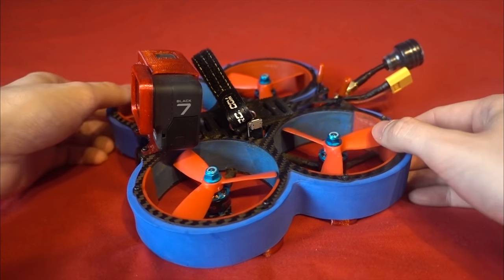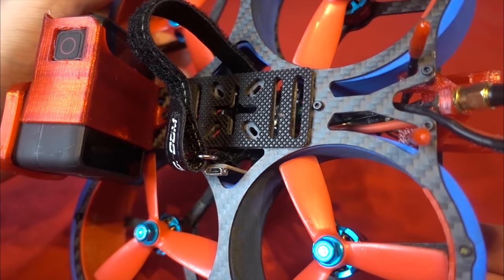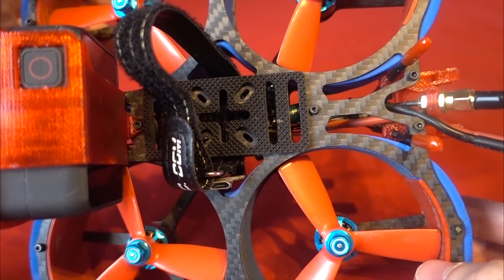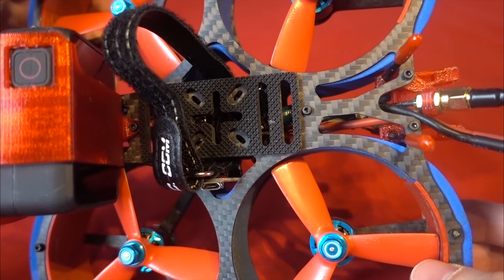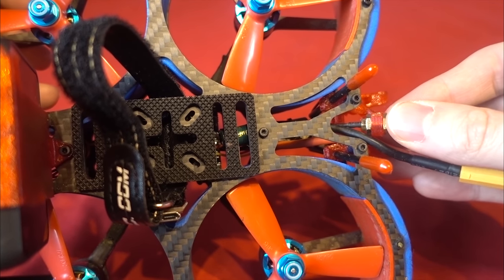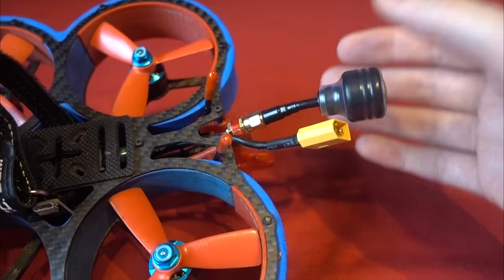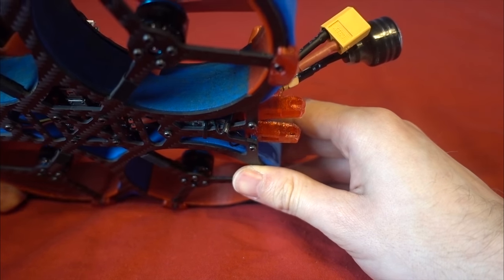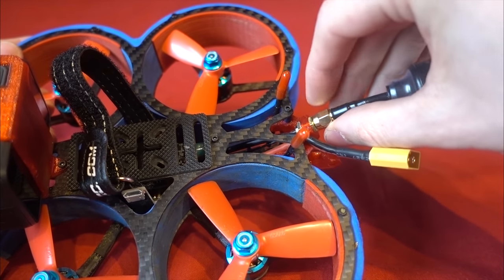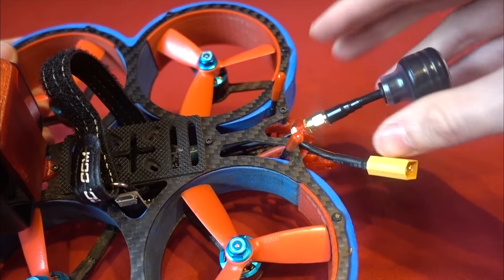The VTX is HGLRC's own Forward MT Mini switchable VTX, up to 600mW, so you will get very decent range with this one. It's using a micro-UFL connector though, which I'm not a huge fan of these days, and it doesn't seem to be secured down either. They have used an SMA pigtail which has some slack in it, and the 3D printed mount is very flexible. It looks like the 3D printed part can also hold a crossfire antenna. They have also provided a long circular polarised antenna, which I like, but make sure that you keep it tight, as it seems to loosen itself over time, which could end up damaging your VTX.